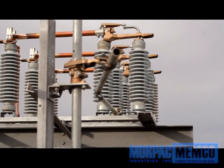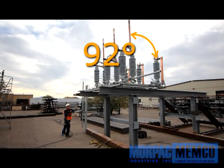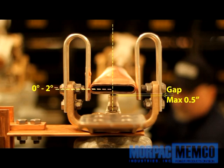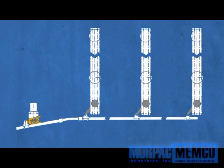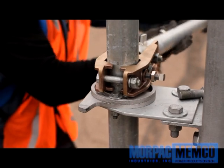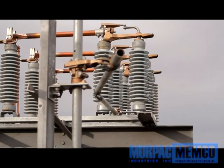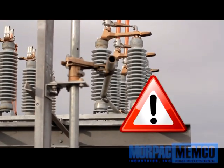Make a trial opening while being careful not to overstress the linkages. The goal is to get all three phases to open up to a 92 degree position and close properly, with the gap being 0 to one half inch while also being overturned by approximately 0 to 2 degrees in the closed position. This is achieved by several clevis adjustments on each phase. After adjustments are made, the outboard crank should over-toggle in both the closed and open positions — in essence, lock itself into place. At the same time, the swing handle should achieve a 180 degree swing plus 1 to 3 degrees to compensate for the over-toggle in both the open and closed positions. Do several trial opening and closing actions while monitoring all components for stress. Do not force, as this can and most likely will damage components.